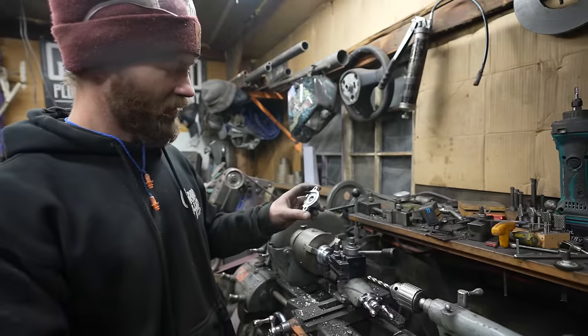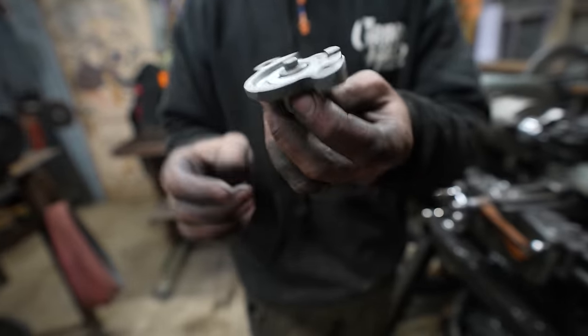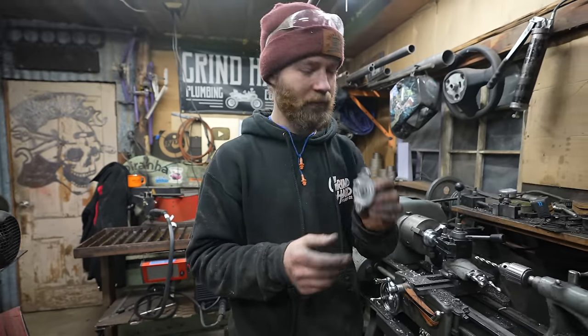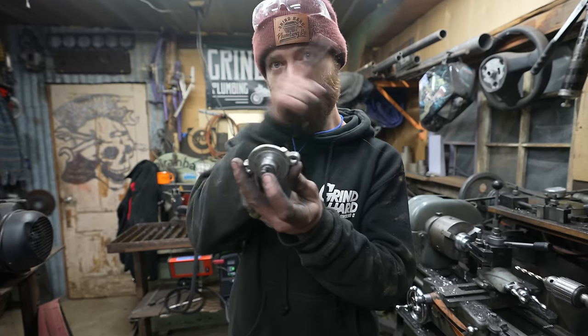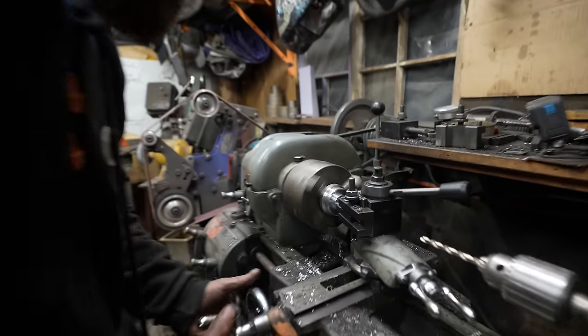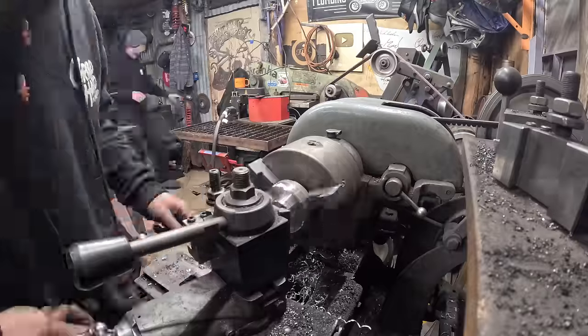Making a little knob that's gonna go on the end of this. This is the actual actuator for the diff minus all the electronics and some of the aluminum. So basically it needs to spin this eccentric thingy around to move a slider back and forth. So once you finish that, you'll be able to manually select four-wheel drive or not. Precisely.